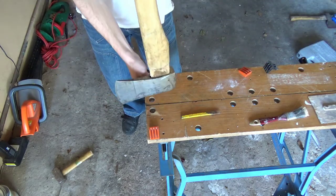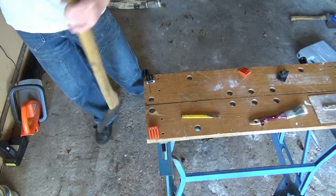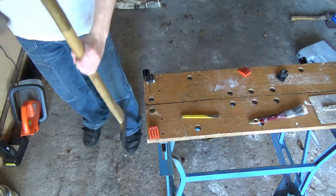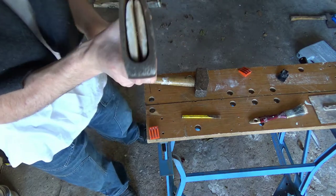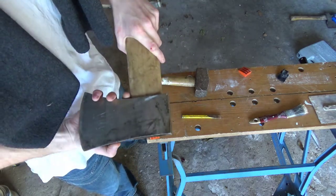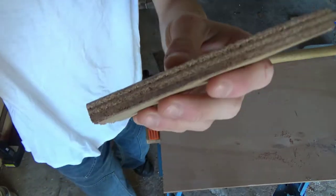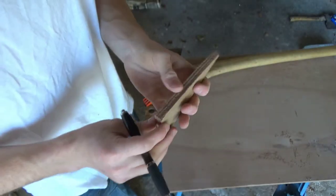That should be fine, because I've sort of cracked the wood, so I don't really want to put any more stresses on it. So now it's just a long process of putting the head back on it, and then somehow making a wedge. Yeah, it went on. Now I just need to get it on a little bit further. Maybe that's why they filled it full of epoxy - but still, there needs to be a wedge. I will be back once I've found something suitable as a wedge. What I have found is this fireboard, I think it is. Basically it consists of three levels of wood, and if I take one of those levels off, it should be good for a wedge.